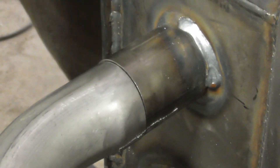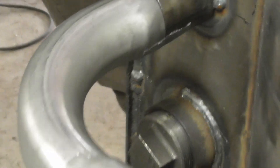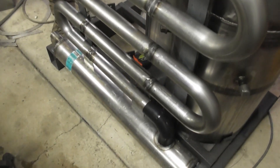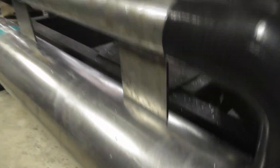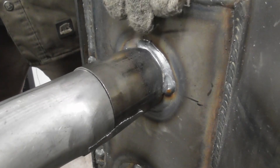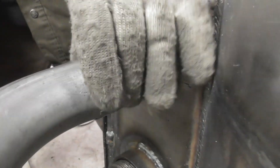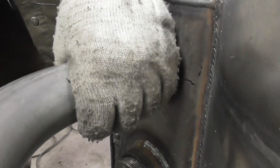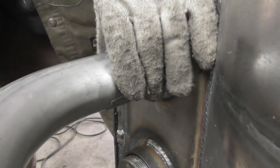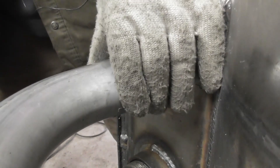Now this is where we've just got this sort of dry fit. This is welded in place. We built the cooling tube assembly, which we just completed and just leak tested, and we fit it on here as a dry fit. We want to make sure that this is lining up perfectly. We've got to have good metal-on-metal connection from the outlet coming off of the heat exchange to here — we don't want to have any offsets or any gaps. And then we're going to put a high-temperature silicone connector on here as well. This has got to be a good, strong metal-to-metal connection.